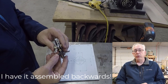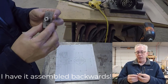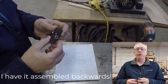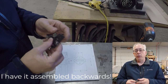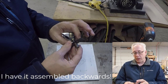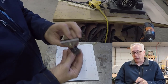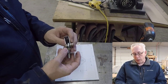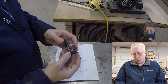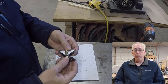And then we just basically made a mounting plate that has two holes that you can put screws into. The big thing with that is we want to make sure that this doesn't rotate after you've got it enclosed in the rudder. And it's very important that you have something that will take the anti-torque on it by putting two screws through this plate. As you can see, we've got two screw holes. So what I'm going to do now is move on to how to make the mounting and the pivot bracket that gets mounted to the back of the fin.